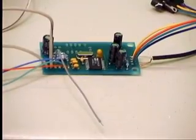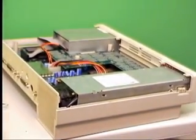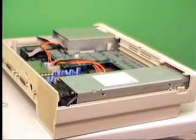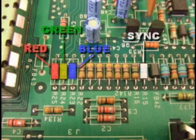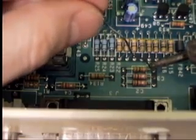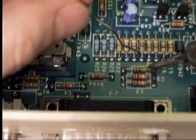Here's the Neobits board with all the wires attached, ready to be mounted into the Amiga. Now it's time to solder the wires to the various parts inside the machine. You can see in the diagram where I'll be connecting the wires to get the signals I need. For ground, I use an unused ground pad on the motherboard, and then I solder the remaining wires into place — first adding some extra solder to the legs of the resistors, then attaching the wires.